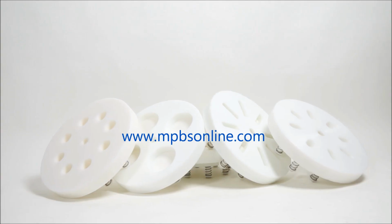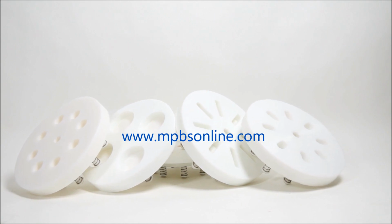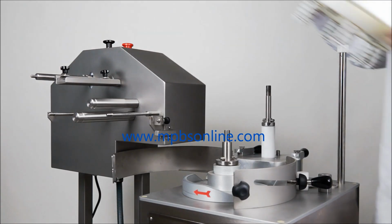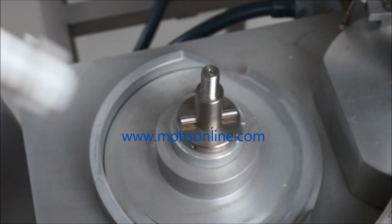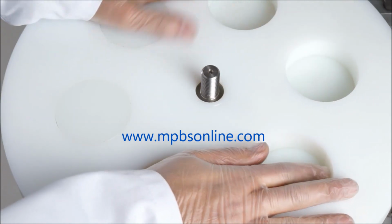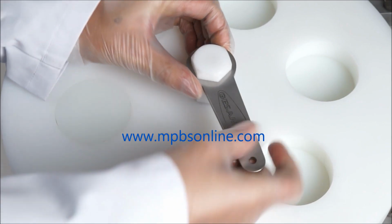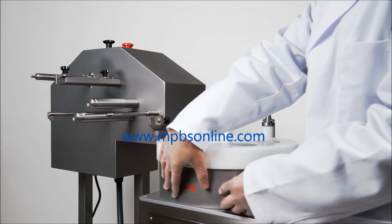First, the mold is selected according to the product to be made. The protective cover of the ejectors is opened and placed onto the central shaft, ensuring that the safety slots on the plate are lined up with those on the feed shaft. The assembly is locked with the polyvinyl key, and the protective cover of the ejectors is closed again and secured with the nut.